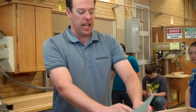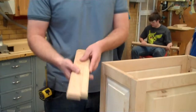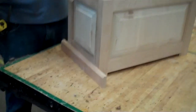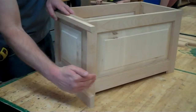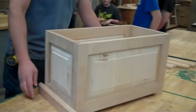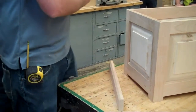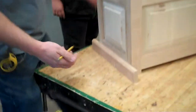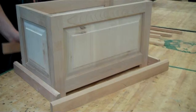Before we cut those miters, number 10 says use the miter saw to cut a 45-degree angle on one end of each molding. The wide piece is going to go on the bottom with the routed edge facing up, and the smaller piece is going to go on the top with the routed edge facing down. We're going to cut these at a 45-degree angle so they wrap all the way around on the top and bottom. I found it's easiest to cut one angle first and then match it up and cut the second angle.